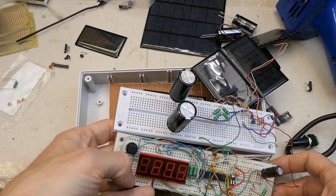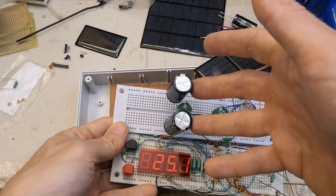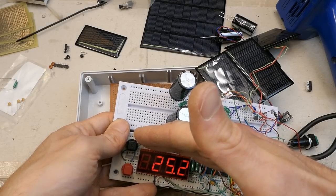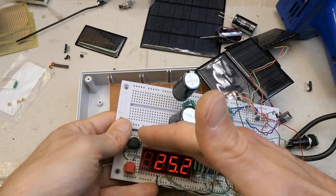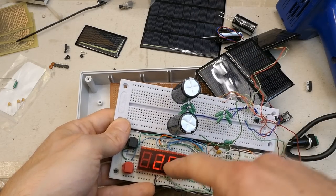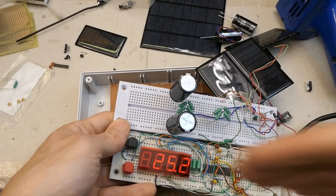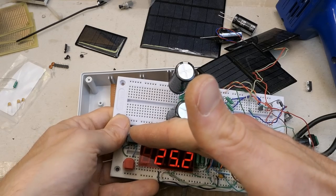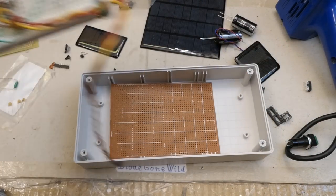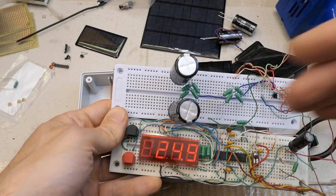It has a brightness control and a minimum/maximum memory. I plan to use several capacitors — maybe eight or nine — and these can run it for multiple days. I'm using the most efficient red display I could find. A pure green display would be even more efficient but would require two capacitors in series, whereas a red one can run on all in parallel, making it simpler. A red display is also better readable from a distance and doesn't disturb sleep as much as green. Later in the video I'll show the schematic or put a link in the description to my website.